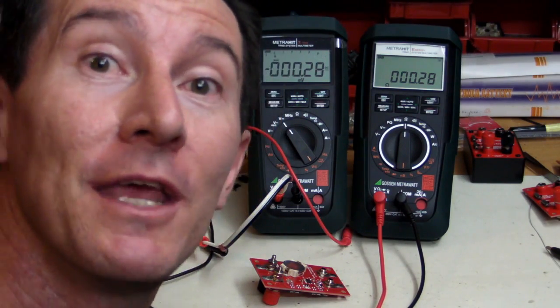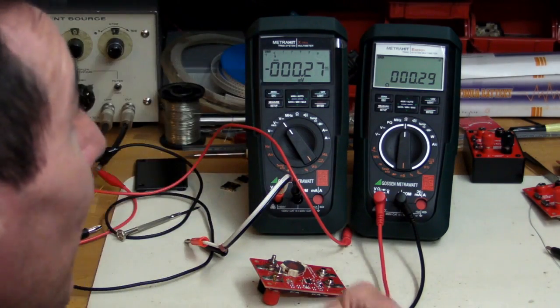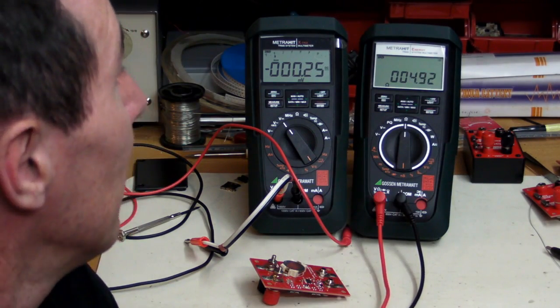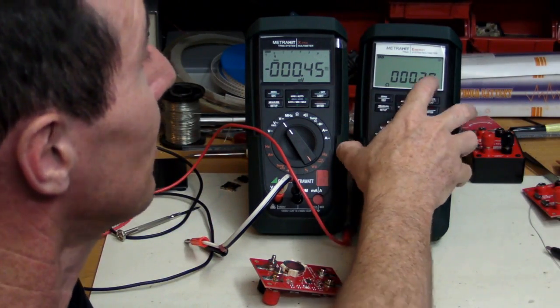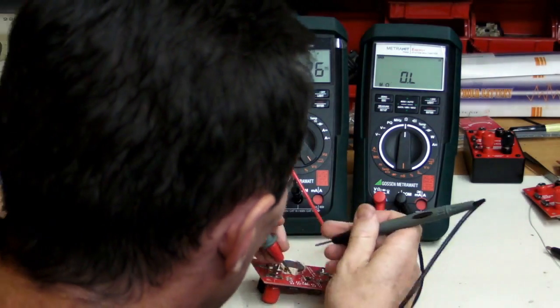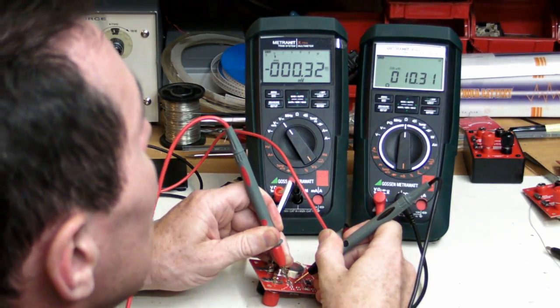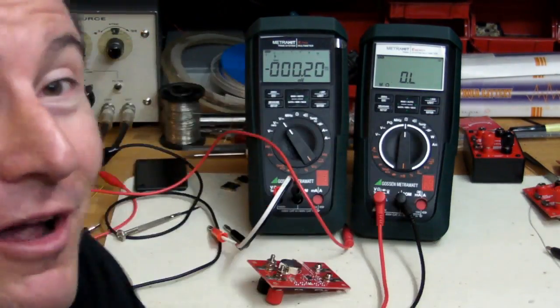Because we're talking about a 0.1% resistor at 10 ohms, 0.1% represents 10 milliohms — 0.01 ohms. So you have to zero out the residual resistance of the test leads. The MetriHit Energy reads 0.29 ohms on a short, so we zero that out. Then measuring the resistor: 10.33, 10.34 ohms. Bingo — the resistor is about 3.3% out of tolerance. Unbelievable.